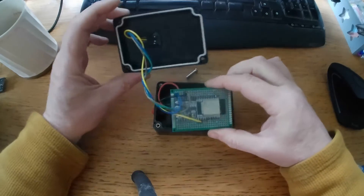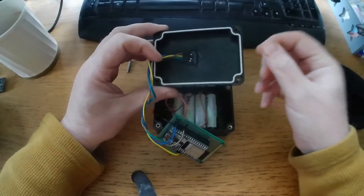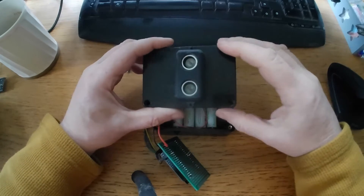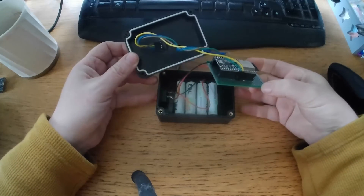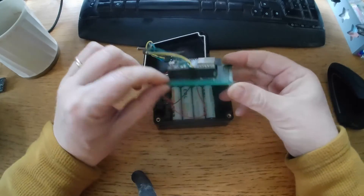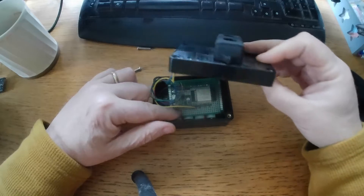With the ultrasonic sensor we have plus five volts and ground, then the signal for the ping and the signal for the receiver which receives the ping. So one sends the ping out, one receives it back, and then the maths measures the difference between the two to get the depth. It's really simple, and obviously there's an on-off switch as well. Very simple, compact setup, soldered onto this prototyping board here, and it all fits nicely back together.